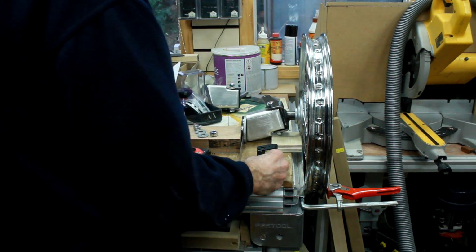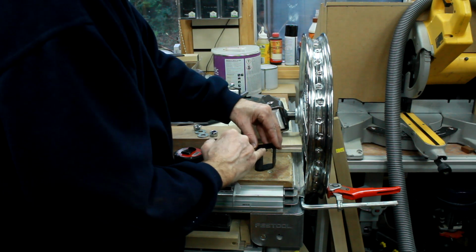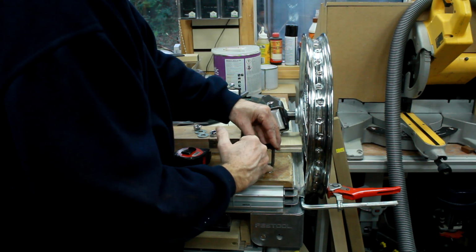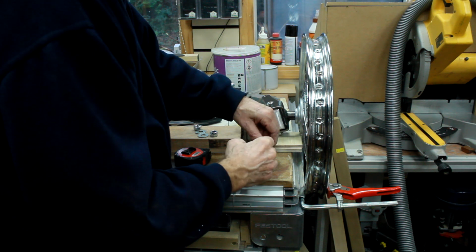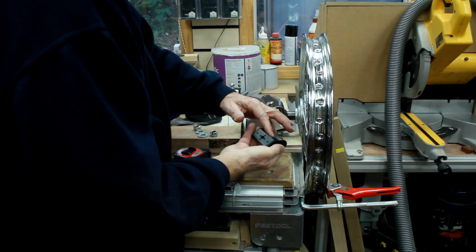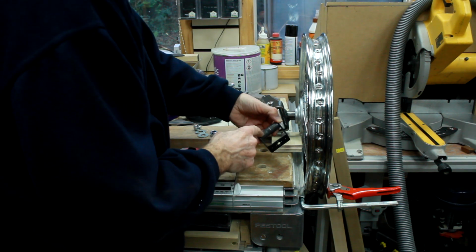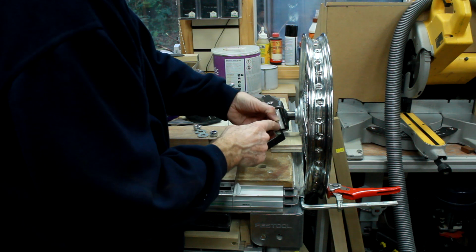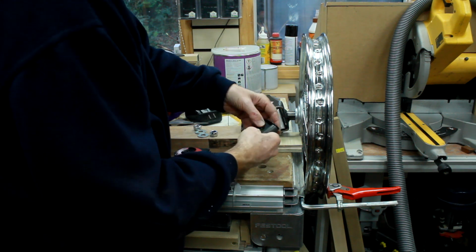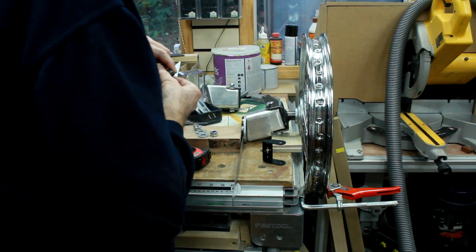And then there is the question of whether that part is strong enough, and what it means now is I can again get some plate, stainless, and get the welder to weld up that whole centre area there as like a gusset. I can still get in to bolt them up, but it will just make that whole thing into a really solid section that's welded to the upright, welded to that, welded across top and bottom, triangulates it all and makes it much stronger. So I can get them to do that.